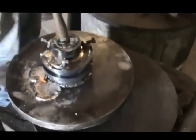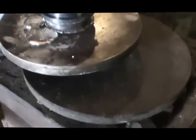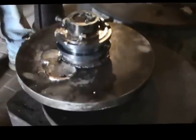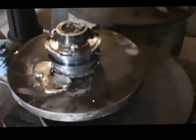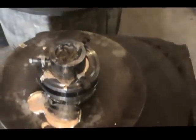Well, a couple of things that we've learned: when you're going to pour the Babbitt, the base plate that we're setting on needs to be nice clean metal so that the Babbitt right will stick to it properly. The other thing is it looks like we have an issue with it migrating into the dummy bearing on the bore side of it. So I think another time it would be better to have a solid shaft for the dummy bearing, or cap it in some fashion. If you only had a piece of mechanical tubing like what we used, we could put a plate on the bottom of it and weld it on, and then have that setting on the bottom. Yep.